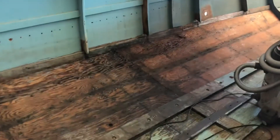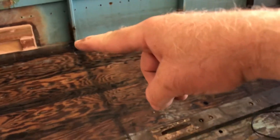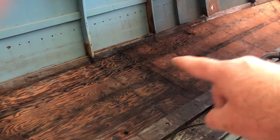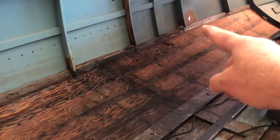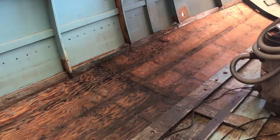That support setup was necessary because all the interior framing has been taken out. There were cross frames that went from side to side at each rib, and then there were bottom stringers. There are two stringers still on the starboard side; I took one out. On the port side I took all three stringers out. The one by three white oak will replace the stringers, and the one and a quarter inch white oak goes along the chines. I'm going to add an additional chine member for about the first 12 feet of length. The African mahogany is to replace the side-to-side framing.